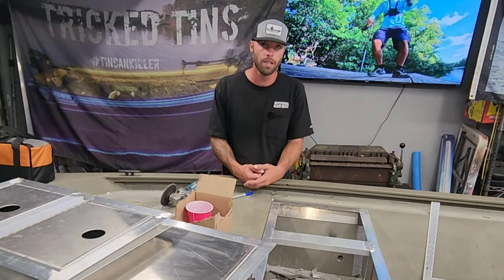If you don't want me to do it, if you think you can do it yourself, the simplest way I would do it is just cut a flat sheet that fits in here. If you don't have a way to bend the sheet, then take a piece of angle, just like this piece down on the floor right here, same type of deal. You just run it to the floor across here and run it up, and then you can shoot some rivets through your sheet, hold it up. Same thing on the face and same thing here. You don't even have to have a solid angle. It could be a little 2-inch clip here and here and here and here. Same type of deal. It's not that hard.